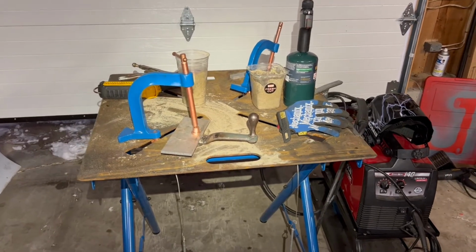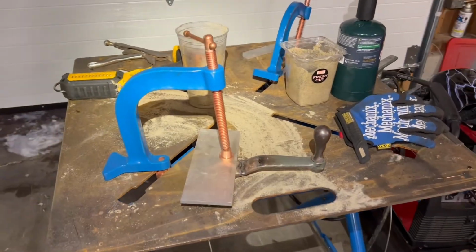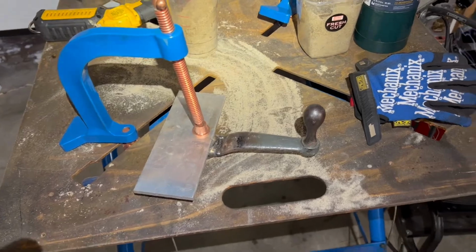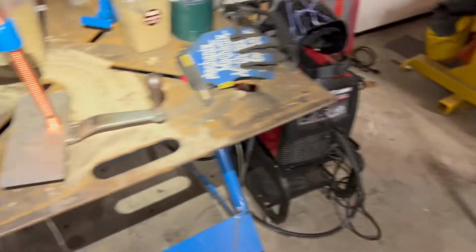Alright, since I welded it on backwards, I've taken it off, flipped it around, and welded the first side. I cooled it in sand for a few hours, and it actually feels like the weld is pretty strong. I gave it a slight bend test. Also did a test fit on the lathe. Everything checks out there. So now I'm just going to stitch the backside together.